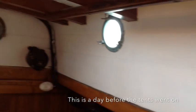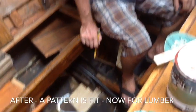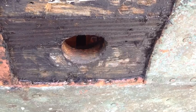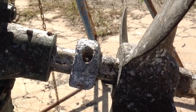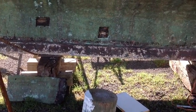Being a wood boat, we can get away with using house paint. Here's the cabin sides all sanded down, ready for paint. Right now we have the boat tented, so work is stopped for a couple days until the tent is off. Varnished the countertops. There's the plank that we're replacing — I made a pattern piece and fit it in. We're going to put bung blocks in and get a nice piece of cypress. This is where some corrosion on the copper happened. Tar is still dripping out of the copper, which is a good thing. And there's the lead keel, which we're going to paint — bottom paint.